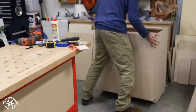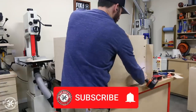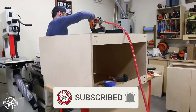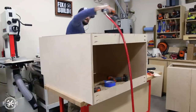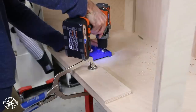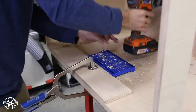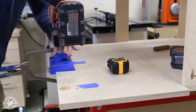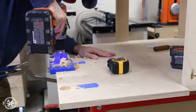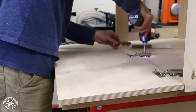The second cabinet carcass is made exactly the same way as the first until we get to the internal storage. If you're new to the channel and you like what you're seeing, go ahead and subscribe so you don't miss the rest of my shop build out. This cabinet is going to have a shorter adjustable shelf that will leave room for storage on the doors. I clamped a piece of scrap plywood to the front edge and used it as a reference for the jig, which worked out great. To account for the extra weight of the storage on the doors I went to 3 hinges on this cabinet versus 2, adding the extra hinge right in the middle of the door.